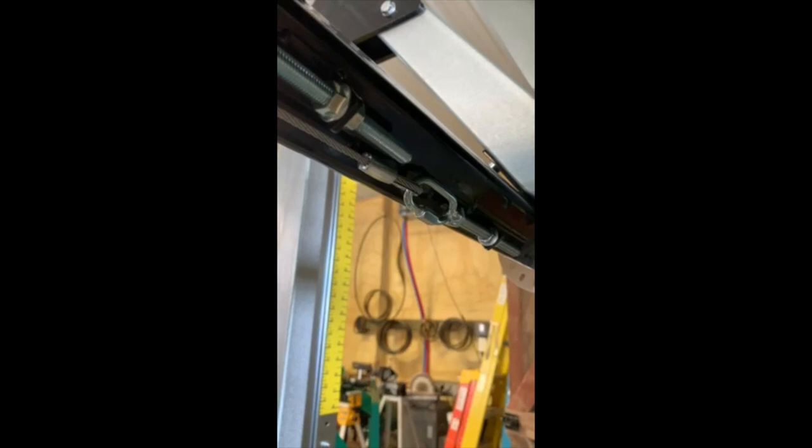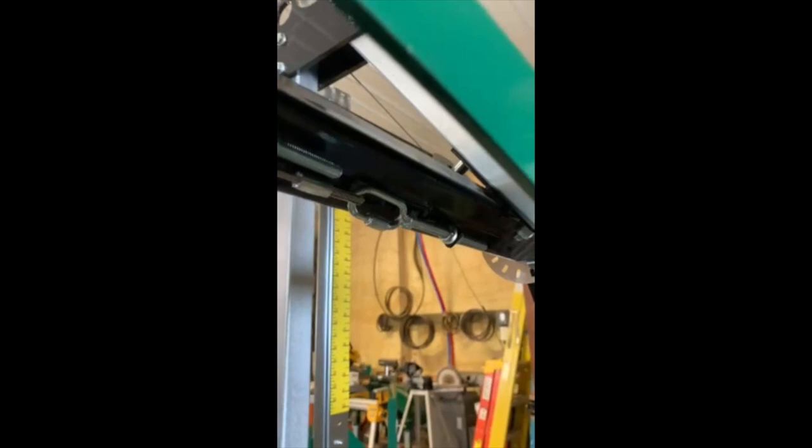So you crank it down, and then these cables become loose, and then you can just by hand spin the nuts until you get it right where you want it, and you got to crank it up naturally and put tension on it. But when you can sit there and crank up and down and play with it, measure side to side till you get it exact, and then make sure you lock the lock nuts together so it doesn't move in the future. But once you've got that set, it'll probably be good for maybe forever. But you want to get it so it's exactly the same distance.